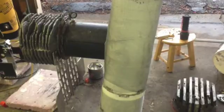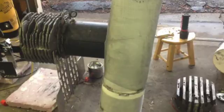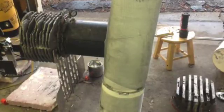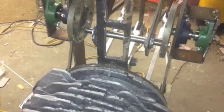There is also aluminum screening surrounding the outside of the displacer. This acts as a regenerator as the hot and cold air passes over the top and bottom. In addition to the displacer, we also added some support bearings to the input and output shaft.